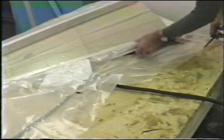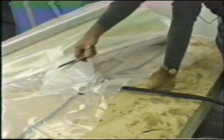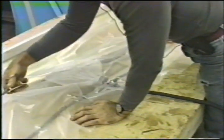I'm going to open this bag up and show you what this looks like. This is the quintessential expression of low tech. We had this heated overnight, tented in a cardboard box that got all the way to 130 degrees. 130 isn't as high as you need to go, but it certainly doesn't hurt to go that high. It helps liquefy the resin and certainly gives you a well post-cured part. Painted white, it's not likely to ever reach 130 degrees.